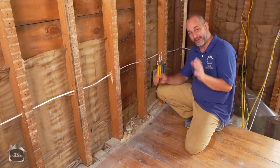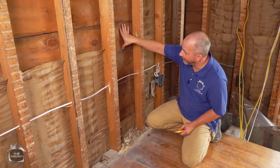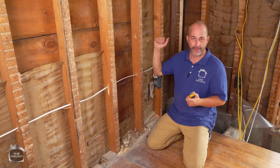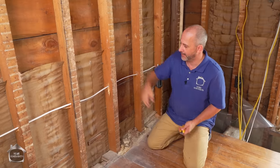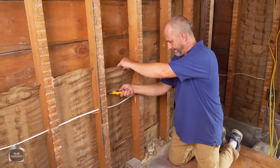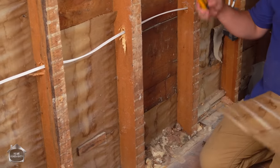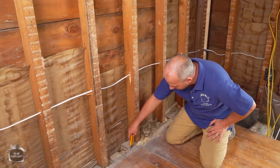Imagine 140 years ago when they built this house — all the studs, all the outside boards here, two layers of them, this is the exterior siding. By doubling it up they helped create a water diversion system by getting rid of the gaps and closing up air blowing through. But before they put the wood on they installed this paper — really thick, rigid cardboard. This was the original concept for an air barrier. They put it all across and on the inside they even put some of the lath nailed over to close up the gaps and reduce the amount of air blowing through.